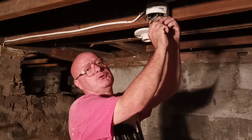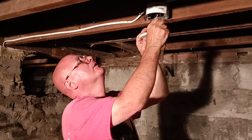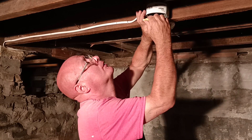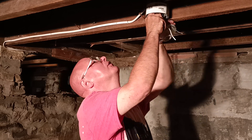So we have to put our ground wires together because if someday somebody down the road puts up an outlet, it's going to be grounded. So we're going to put our ground wires up out of our way here and loop off the box.